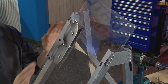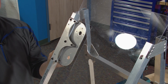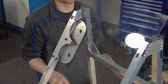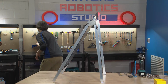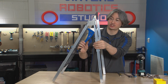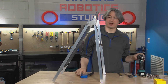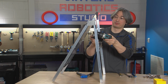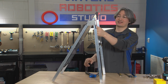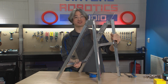That said, once everything is in and in the right spot, like I think mine is, I don't think you will ever really need to work on that rivet again. And if you're in a pinch, if you're in a hurry, and you just need to put another rivet in, you can find the spot that you can go the highest as possible with your riveter. So I could probably rivet here-ish, and not much higher, somewhere around there. What you could do is try to drill a hole there, and because it's a short hole, even if I have to drill on a little bit of an angle, that's okay. And then you can throw a rivet in a little bit lower, and that won't be quite as good as having that rivet right at the very top, but that would work if you were in a rush to get this thing fixed, to go out to a match or something like that.